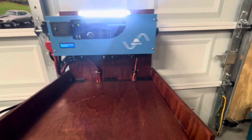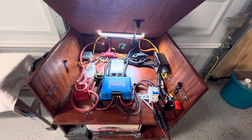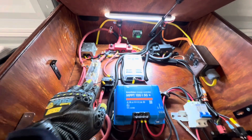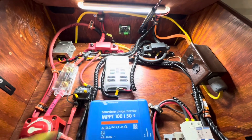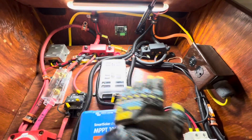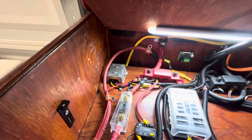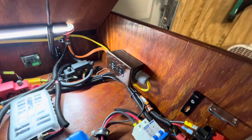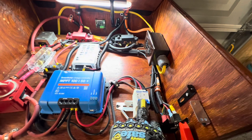I'm getting ready to open up this door and let you see the rest of the system. Look at this — this is the big bus bar down here. As you can see, got a Victron solar charger, an on-off switch, and a fuse. Got a 12-volt panel box where you can hook up 12-volt fuses and run 12-volt off of your wires. Also got a reducer to reduce it down from 24-volt down to 12-volt. And of course you can see the bus bars. There's another place where you can plug more receptacles in as well. Here's the on-off switch for the solar charger, and here's the switch to turn on the solar panels. This one works real good — I'm impressed with this.